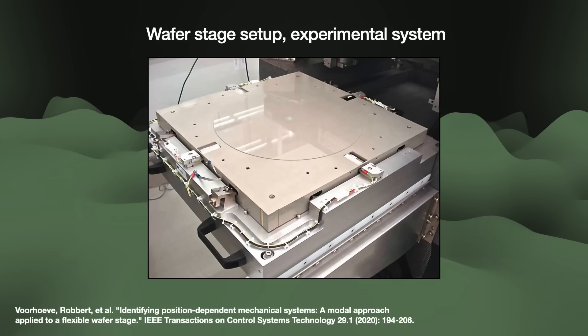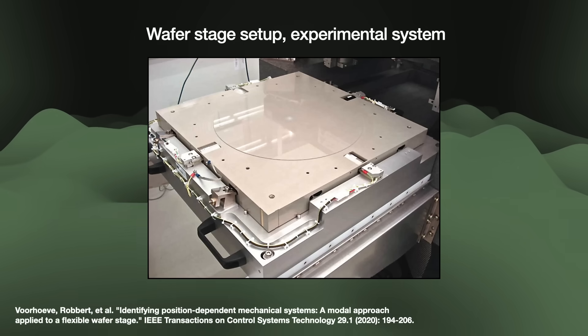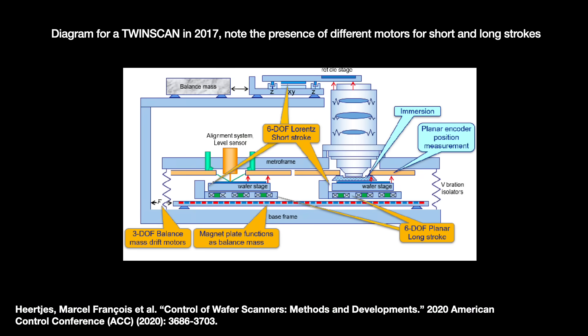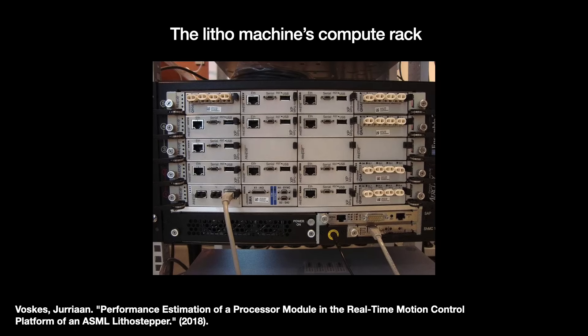Some of the challenges of the design include having to deal with errant magnetic fields interfering with the wafer, as well as cooling which might require umbilical cords or hoses that impede movement. There are interesting proposals to use a single maglev system for generating both short and long stroke movements, which would get rid of the stacked fine-coarse stage system, saving on space and weight. It's a compelling idea with a lot of demonstrations floating around, but the latest documentation still shows the presence of separate electromagnetic motors for these different movements. An ASML machine has to position a 15kg wafer stage with below-nanometer accuracy — the insane precision necessary for this work is difficult to comprehend.